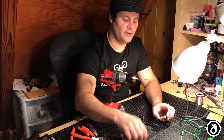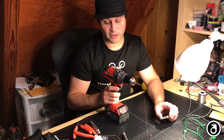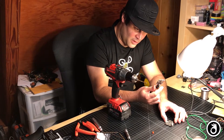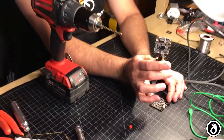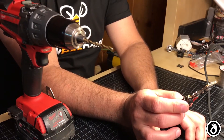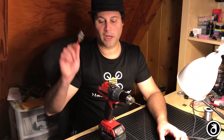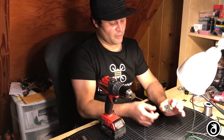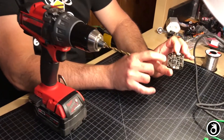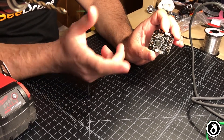You gotta finish with a 5/32 bit - that's going to make the hole big enough so the gummy will fit, and it's also what Raceflight recommends. Don't do it on every single board though. Some boards it won't work - look at how close the edge of the wall of the hole is on Betaflight boards. If you drill it out, most likely you're going to knock off that corner. Also if you see components that are way too close to the holes, don't do it because you might knock a component out.